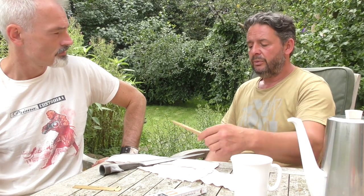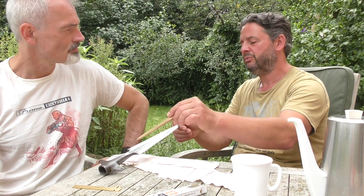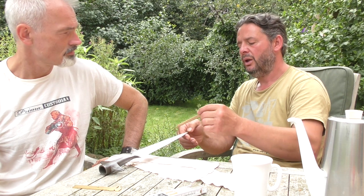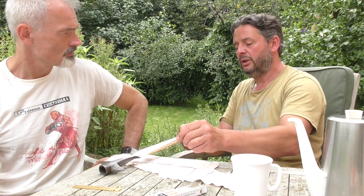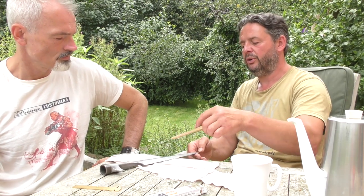Of course, there is the hardening, and this was the part that was not checked on the blade, how hard it was, and if there were any hardening lines like the hamon. I think we can just forget this idea anyway, because only this part really was steel, the rest is kind of a mixture or whatever. So they most likely just hardened the whole blade, and as it usually is, this part here might be a little bit unhardened. Pretty straightforward, and not much can happen to such a thick blade, it doesn't bend or anything.